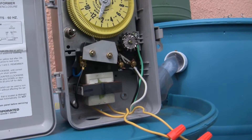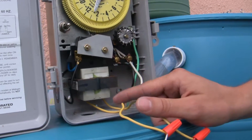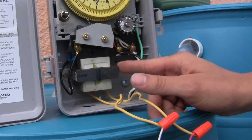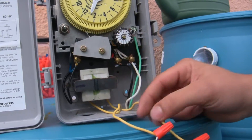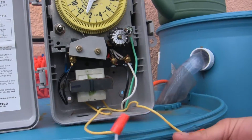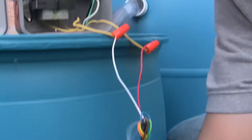Once this is 110 to 120 volts coming in here, it'll drop down through this device here — this is a transformer. It brings the power down to 24 volts, which is what we have here. These 24 volts run all the way down to the valve, and it's what turns your valve on and off.